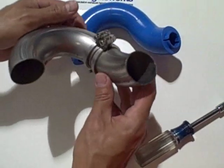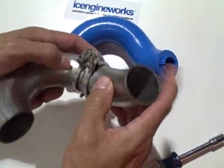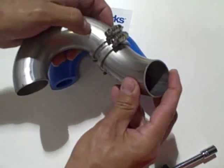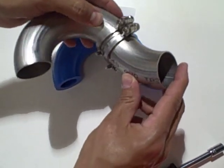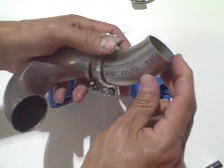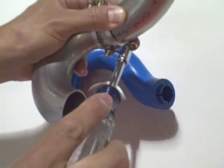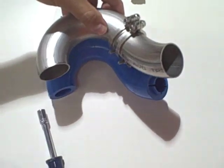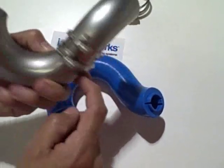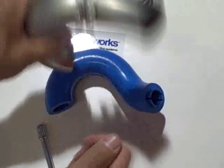With the basic layout assembled — which doesn't have to be precise at this point — we will be able to adjust it until we find the right location to match our plastic model. This is basically eyeballing it without any witness line or calculation. That is one of the features of the clamps: you can do it all manually without any measurement. Very quickly I can tighten it and it is remarkably close to the plastic model. This piece now allows me to test it for fit, and I have room enough between the rings to place a tack weld and make the joint permanent. It is very strong and very stiff.